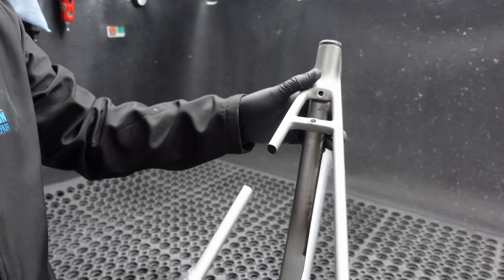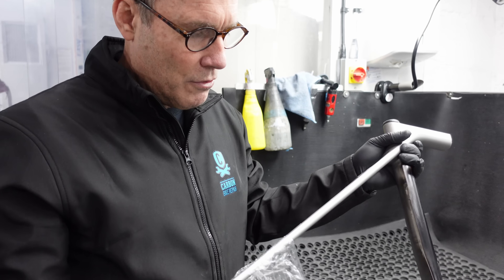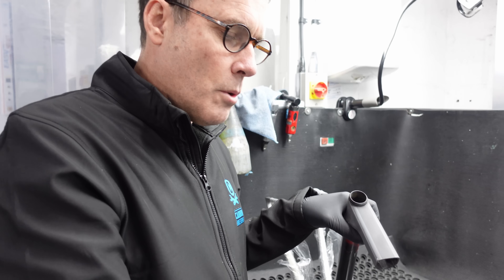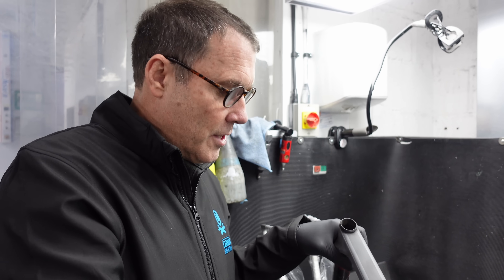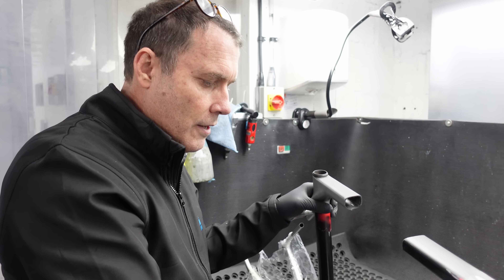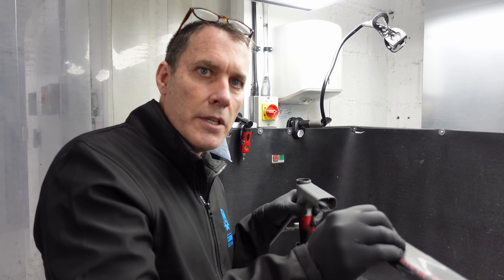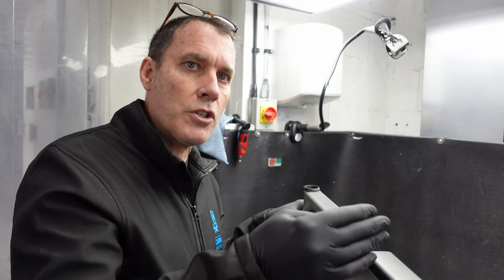The purpose of this is just to stop the cyclist from falling back — that's why it's called a seat stay. Why I cut the top tube off more than anything else is that the top tube is only there to stop the bicycle from collapsing the bottom bracket onto the floor — it's a stopper. So the function of the top tube is actually not a structural element like you'd have in other areas. When you're trying to get a performance bike made, you don't do what Trifox did, which is just put carbon in. That tells me the level of thought that's gone into what the function of that tube is.